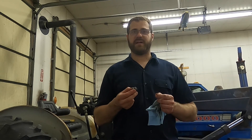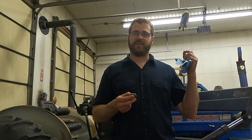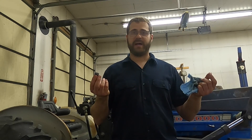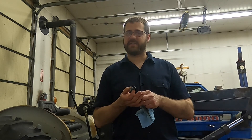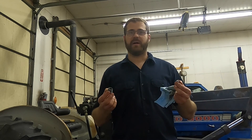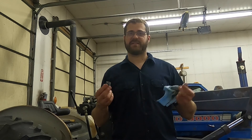The hydraulic pump on this tractor has a C5 part number, which in Ford land means it's a 1965 casting. Even though this is a '73, if they never updated that casting they may still run the C5 serial number. I highly recommend that if you're doing this, you buy two of these compression style fittings from Ford — that's probably your best bet. But even at that, this is just a crappy design. Anyway, that's how to install the high-side pressure line for the hydraulic system on a Ford 3000 tractor. Thanks for watching, hit the subscribe button, and I'll see you later.